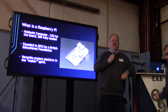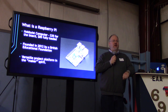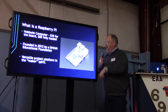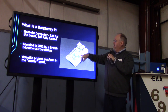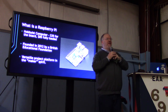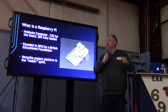So, Raspberry Pi — I really want to explain what it is first, and then I'll talk about what you can do with it in your ham shack. We'll end up with two projects that are relatively straightforward to get started on, that will hopefully whet your appetite to do more with this little computer and start experimenting. Raspberry Pi has a couple of different flavors, but it really started off with this board here — the Raspberry Pi Model B — just a simple board with about 40 pins of things you can interface with, a couple of USB ports, and an Ethernet connection. They've developed and enhanced it over time while keeping the price at about $35 for the board. As the cost of electronics gets cheaper, they've integrated Bluetooth, Wi-Fi, and added some additional ports.